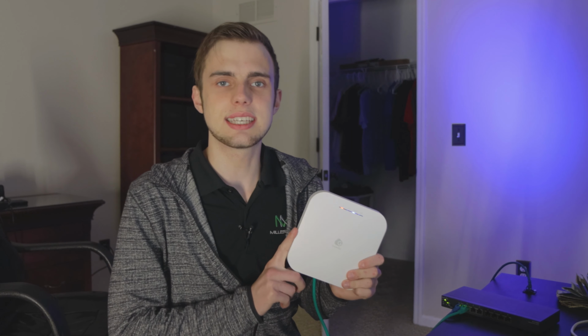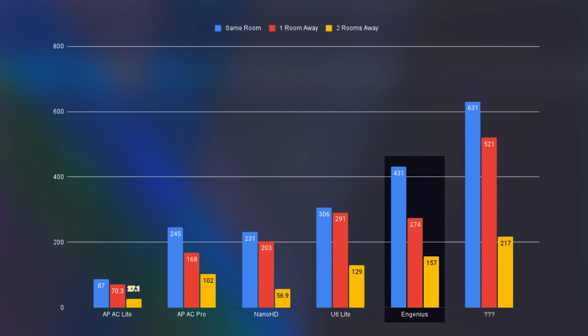Now this is a Wi-Fi 6 access point. It's a 2x2 MIMO Wi-Fi 6 access point. Now testing this access point on Wi-Fi 6 in the same room as my desktop, I was able to get about 430 megabits per second down. Moving one room away, we drop down to 274 megabits per second, and 2 rooms away, we go down to 157, which makes this fall pretty much right in between the U6 Lite from Ubiquiti and an early access point from Ubiquiti that I can't talk about now, but get subscribed for when I have a full video out once that gets out of EA.